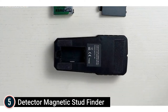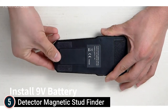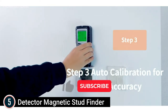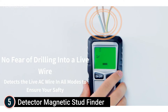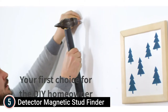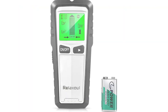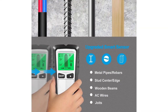The 5-in-1 Stud Finder features deep detection with 5 scanning modes, including 1 or 2-inch scanning modes to locate the center and edge of wood beams, joists, metals, or deeply embedded items. Metal scanning mode spots ferrous and non-ferrous metals up to 2.36 inches deep. AC check mode detects unshielded 80 to 240V AC wiring up to 2 inches. For automatic calibration, lay it level on the wall, press the scan button, and it's ready. When timber, metal, or AC wires are found, the intelligent microsensor chip will blink and beep.